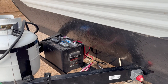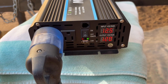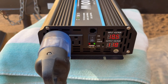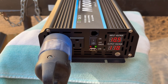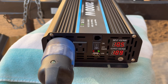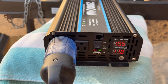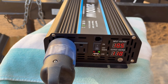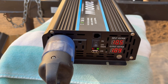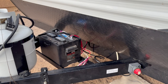I got an inverter, plugged it in, and ran the test — this battery runs the microwave. Notice the voltage is 12.5. When the microwave was turned on, the voltage dropped to about 10.5, and it's trying to make 120 volts output, around 110. I hooked the inverter up to the battery, plugged the shore power plug into the inverter, and ran the microwave for 30 seconds. The microwave just went off and the voltage came back up.